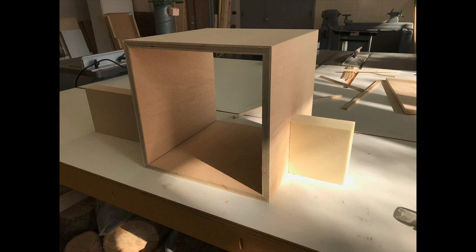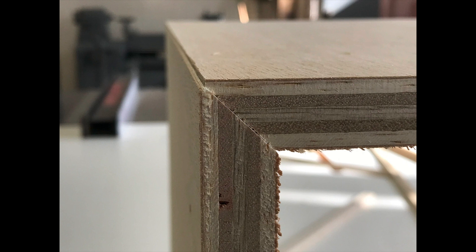A quick verification — are the miter cuts good? I used some foam cubes, left and right, to prop this up, and just carefully put the boards in. It looks really nice. In close-up, you can see that in the top left corner there's a little uncut area. I did that on purpose, because otherwise the edge might be paper thin and could easily break.